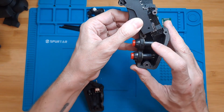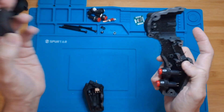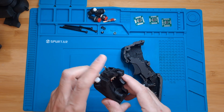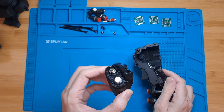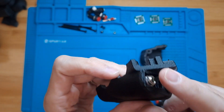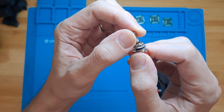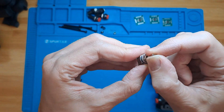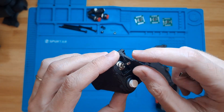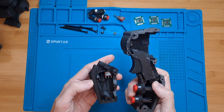You will see that we need two buttons in the bottom, one in the side for the trigger assembly which just snaps into place, and then in the thumb section we have another 12mm button and a three-position flat-stem momentary switch that goes back to center. I prefer the flat ones because they don't rotate — the round ones do rotate, and if you put a 3D-printed cap it may rotate. But if you don't mind, you can use the round ones.